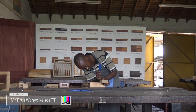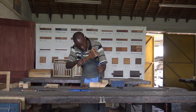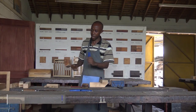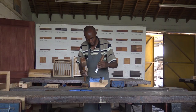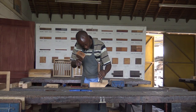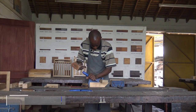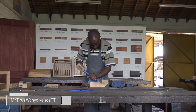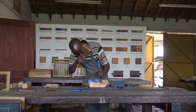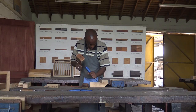And then cut the fibers. Then from there, I can now use the mallet. So first cut, and then I'll use the wider chisel with the flat surface on the edge that I'm not going beyond. I cut a little bit along the fibers, then I continue now chiseling out. So I cut the fibers again. Now I can put some more weight on it. So now I'll start moving.